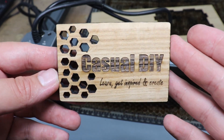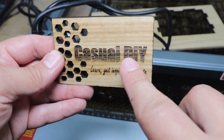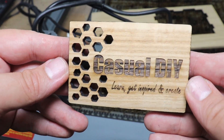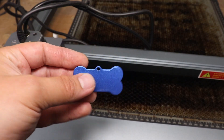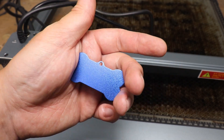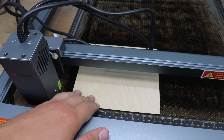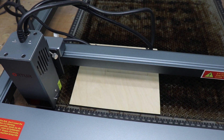And there you go — again a very interesting result. I've actually increased the power from 50 percent before to 90 percent and it's quite deep, so you are getting that raised text as well. Really, really cool. Another product I want to show you is dog tags — basically you can engrave the dog's name on the front and on the back you can put your phone number just in case it runs away. Again we're going to use the sacrificial piece trick — in this case I'm actually going to have two rectangles, one for the front and one for the back.